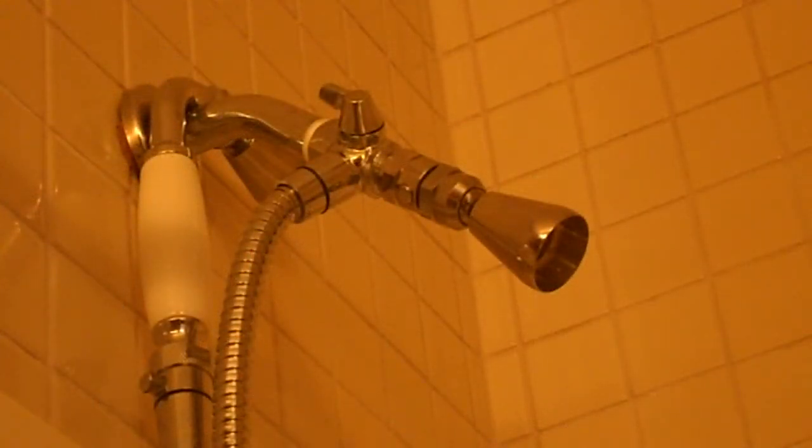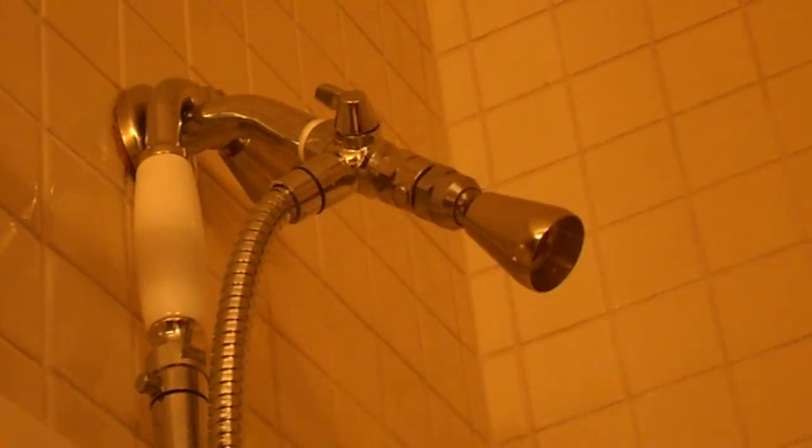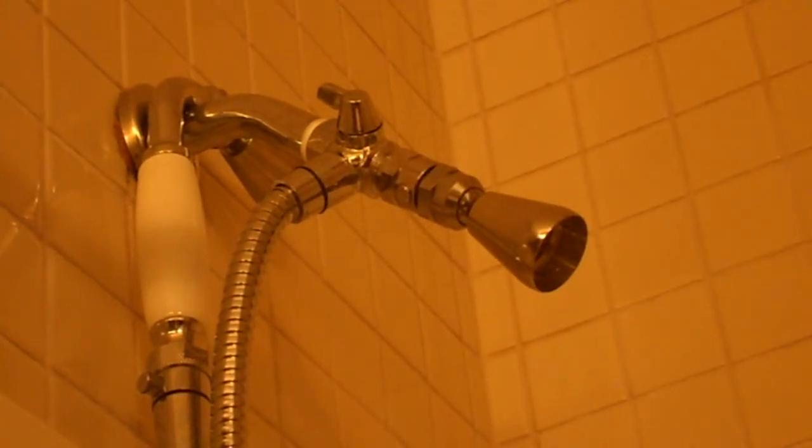and it'll be first time for me as well. There's my current shower head. It's a Whedon. It's also low flow, 2.5 gallons per minute, but I modified that. There's no flow restrictor in that, so what I had to do is enlarge the water passageway with a drill. I think I enlarged it to 1/4 of an inch, maybe a little bit bigger, and it flows a lot better. But I bought this diverter, and that diverter has a pretty small passage in it, so it might be restricting the water.